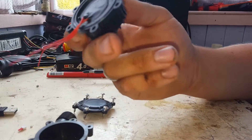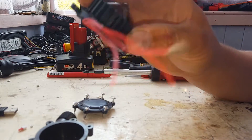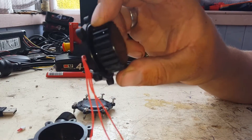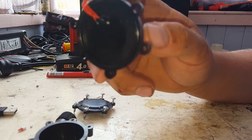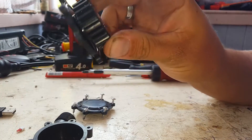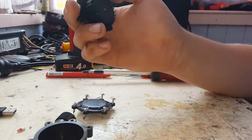I'm going to get hold of one of the 5-volt DC ones — one of the ones that is supposedly already rectified. But in the meantime, I'll build a little rectifier bridge for this so we can get a couple hundred milliamp hours out of it at 13.8 volts, say to charge lead acids, or put it into a lead acid and then use that to charge some lithiums.